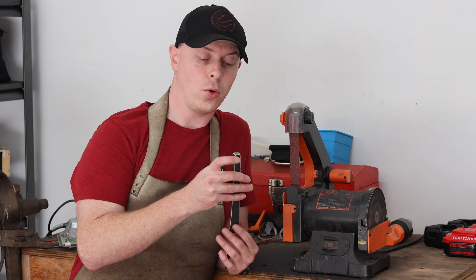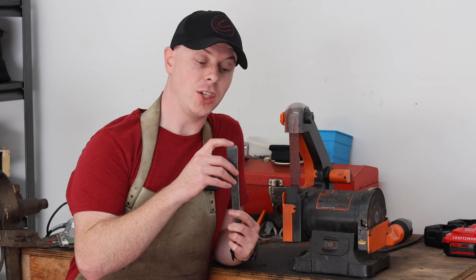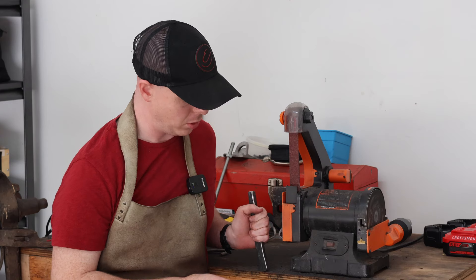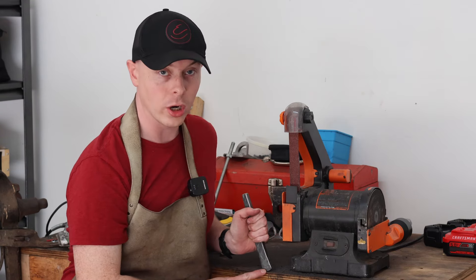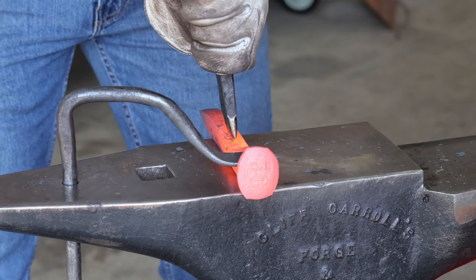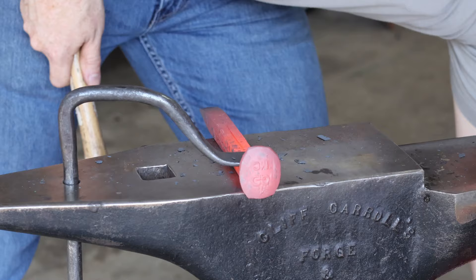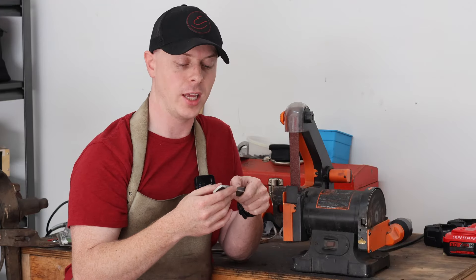I've got this rough ground to a dome here on the struck end and I've got the tip of the chisel ground to a little bit of an arc, and that is intentional. This allows you to seat the chisel in a cut, hammer down on it, and then seat the corner in that little groove that you just made and rock into the motion and hammer down on the next spot. You can walk your way across a piece of steel really easily with a little bit of curvature to the tip of the chisel, as opposed to being perfectly flat like you would get out of a wood chisel.